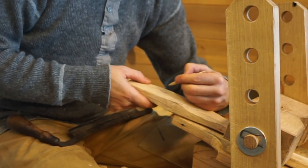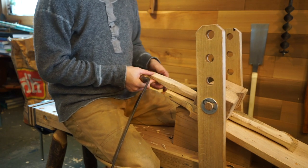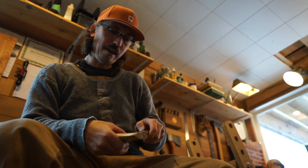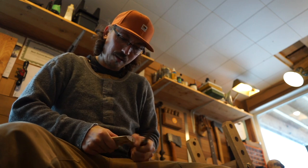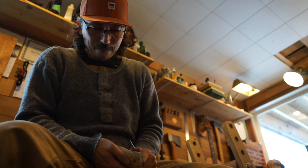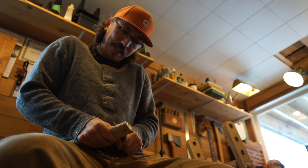For us, we want the bottom of the axe to sit right about there — there'll be about three quarters of an inch sticking out the top. Once that's done, I find it easier to take my sloid knife and carve away these pieces because it's not locked into the vise or the shave horse. And now I can start to feel where it needs to be taken away, with a little more control over how much I'm taking away.